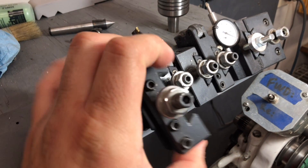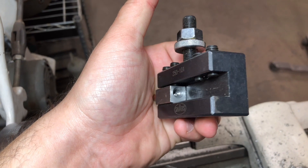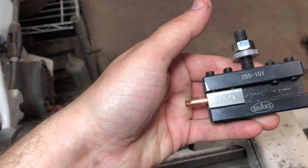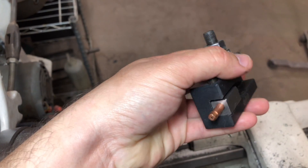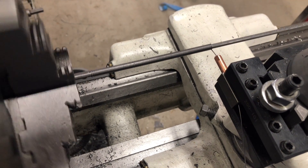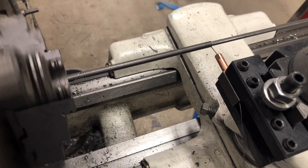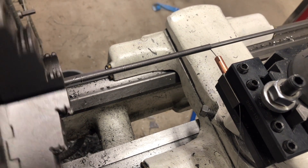I had to wind it into a coil though, and I did that on the lathe in a spring winding technique. I made a custom tool that has a MIG welding tip on it, and this helps feed the wire over onto a mandrel. I then set up the lathe as if to cut a thread away from the chuck. The resulting coil was very satisfactory and consistent, although you could probably use any kind of spinning tool to make this.